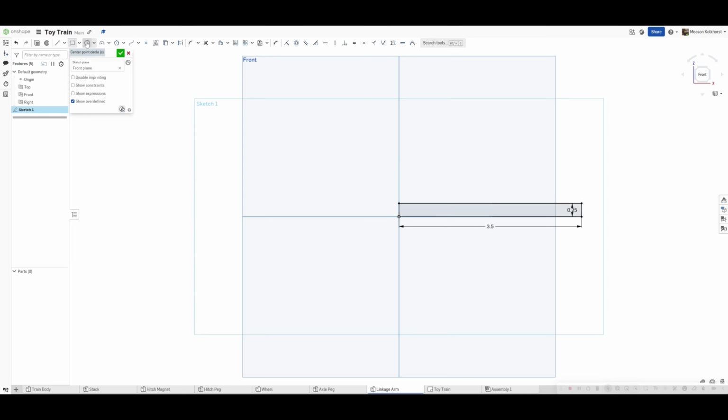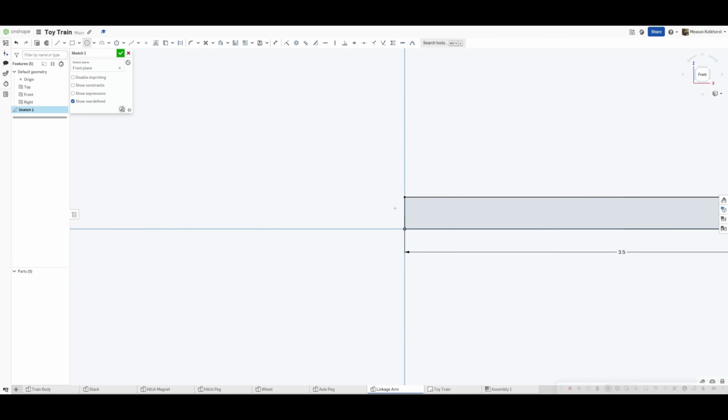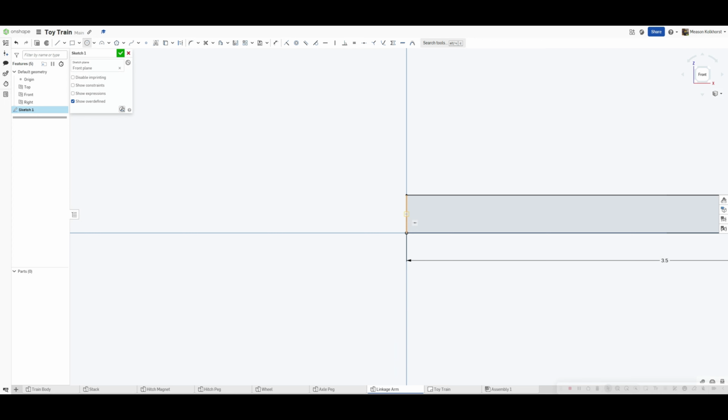And now I'm going to start doing circles. So when I look here at the end of this, I'm going to say I'm in the center point between the top and the bottom. Click, I make my inside circle, and that is 0.128. Oops, 8. And then I make my outside circle, which is radius of 0.1875 times 2, because a radius is half the diameter.